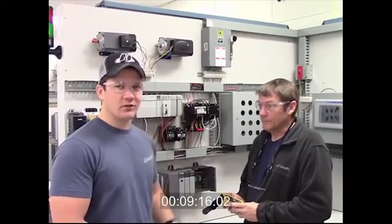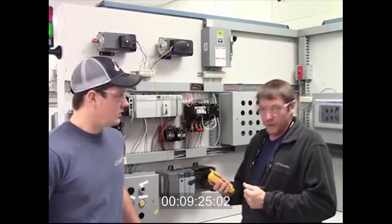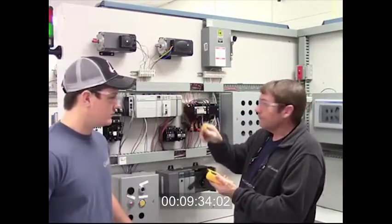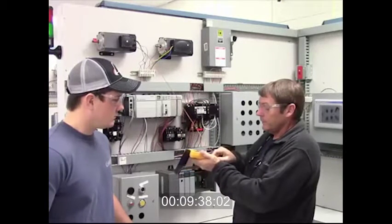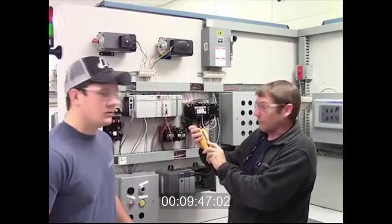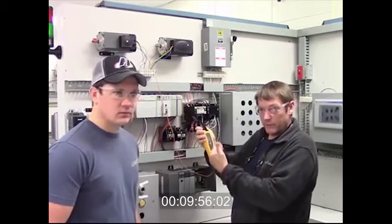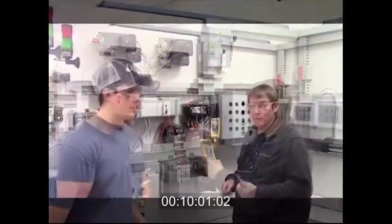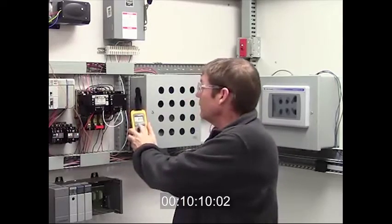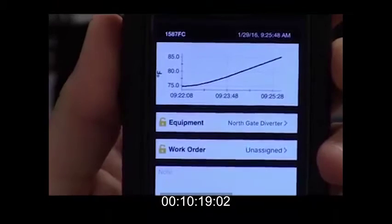The PM on this motor on the North Diverter Gate tells us that we need to do an eight-hour temperature analysis. I'm going to be doing the temperature analysis with the Fluke T3000 FC. I'll go through the procedure of hooking it up — the probe is already connected to the North Diverter Gate motor. It does have a negative and positive polarity on the plug-in. We're going to set this up to log for eight hours. The motor will run not continuously but will come on and kick off as needed during operation. After eight hours, we're going to pair the device by pushing the Fluke Send button, which will send the info over to the paired device. Here is the trend graph, and as you can see throughout the eight hours the motor did get significantly hotter throughout the day.